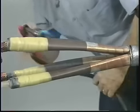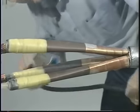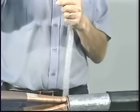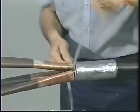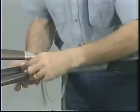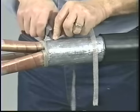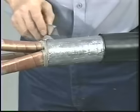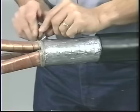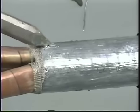If you have belted cables, discard the mesh and continue with the next step. For screened power cables, install the one-inch copper mesh supplied in each kit. Fold the mesh in half lengthwise and wind it around each phase shield as close as possible to the lead sheath cutback. Cut off the excess and carefully prepare the lead sheath using a clean blade to ensure better bonding during soldering. To complete, solder the copper mesh to the lead sheath.